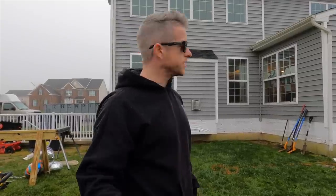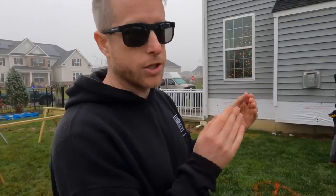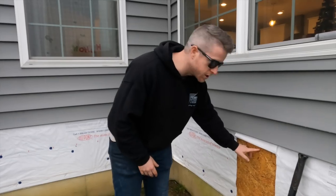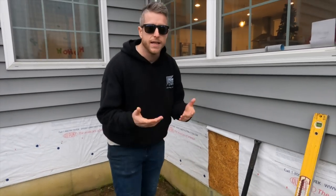One of our biggest things here is the transition into what is gonna be a new door. So we were talking about taking a measurement off of that door using a laser coming over here, but then we're just assuming that this house, the foundation, everything is totally level, which I don't know, hopefully it is. Hopefully it's pretty close, but you never know. So what Ant's gonna do is actually just cut out a piece of the sheathing, then he can see the framing and we can see where that finished floor is.